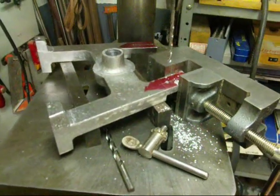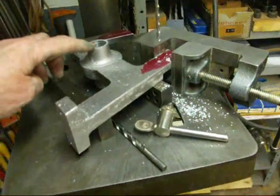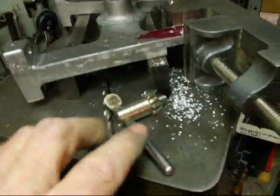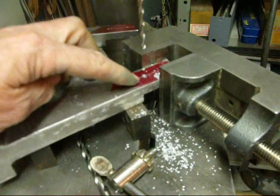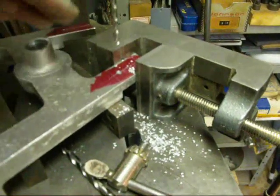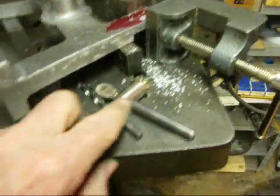Here's the setup for drilling these holes. I've given you some of these details just for ideas. Since this piece won't sit flat — there's a hub on the back side too, and furthermore it doesn't sit flat because it's a half lap — what I've done is place the work on two parallels, which are about an inch and a quarter, and that gets me off the table. The whole work is going to tip when I force the drill in there, so I'm holding it with a drill press vise set on its side. That holds it firmly since I couldn't find any waste stock to put under there to support it. So that's how I'm drilling it — a pilot hole and then a quarter inch bit.